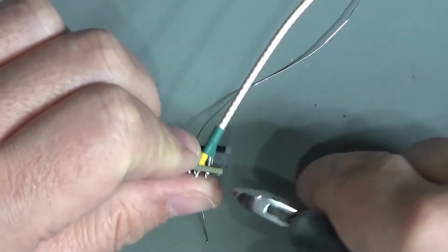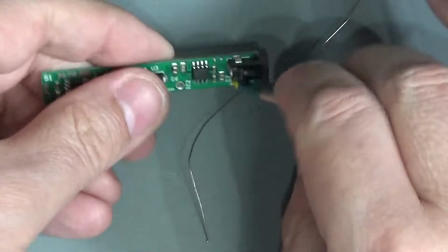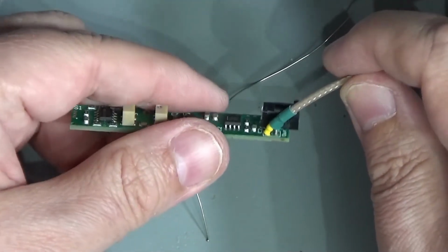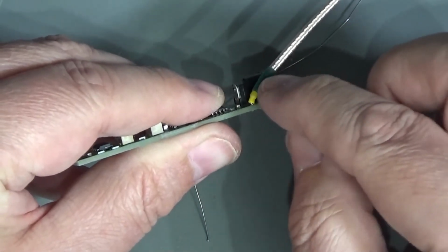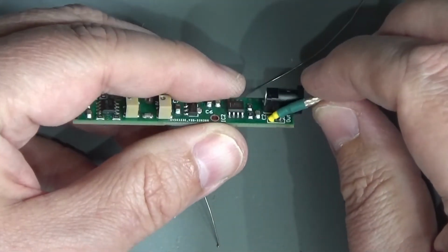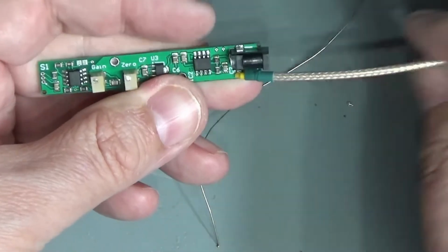We've learned that there is a bit of twist that applies on this socket when it's soldered in place. I mean, it will go out the case, but no strain relief. This would be better if it had the strain relief molded on. I've just used a couple of pieces of heat shrink for that, which are probably going to get in the way, but anyway, we'll see.